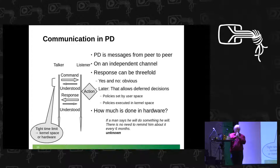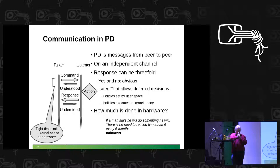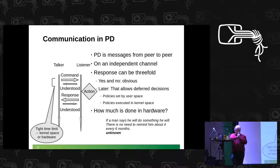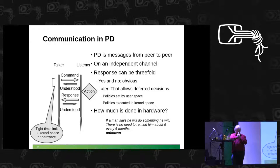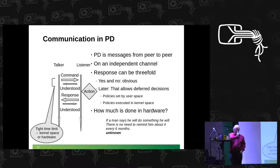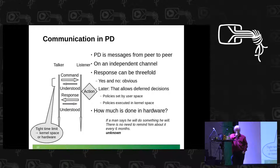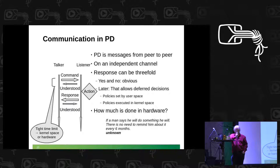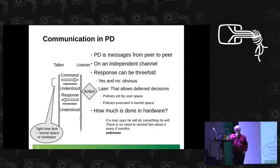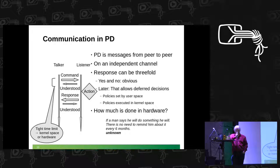If you don't like that, you can switch the hubs to fully dependent mode, and then every request is rerouted to the host, which has full control over the power budget in the system as a whole. How does it work? The power delivery thing on a technical level is most similar to a very primitive Ethernet. It's implemented as a frequency modulation on top of either the power supply or a control cable. So it's arcane. In contrast to USB, it is a truly peer-to-peer thing — every partner on that wire can talk to the other one. At a maximum, there are actually four partners on each connection.